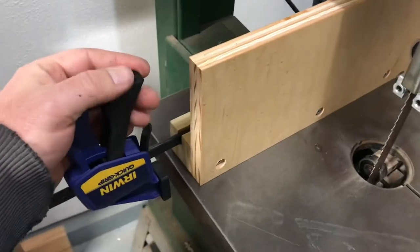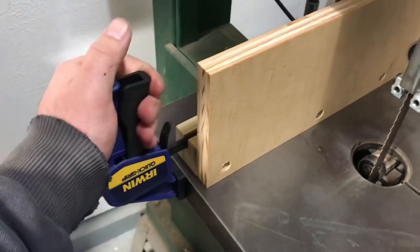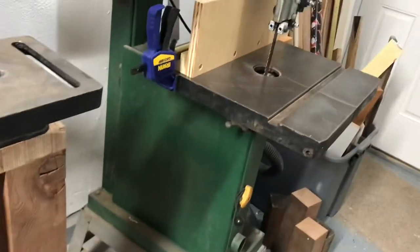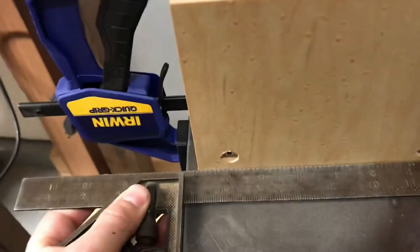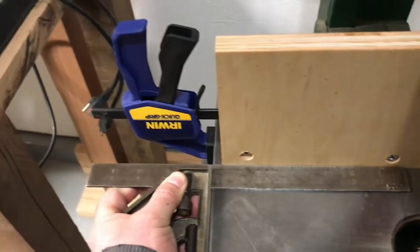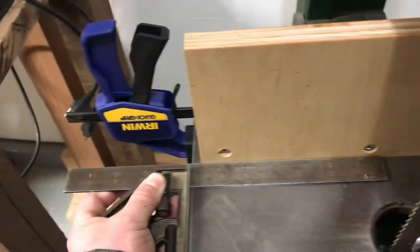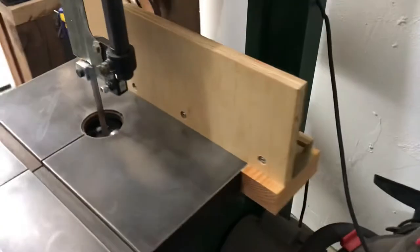So I've noticed it's about 50/50 — even with the spacing I put in there for the clamp to move, for it to be perfectly square. But what's nice about this setup is you can grab your speed square, regular square, whatever you've got, and just verify it. This is one of the 50% where it worked out perfect — it's in there square. Like I said, about 50/50. Super simple though: just loosen the clamp, butt it up against the square, and retighten it. For quick stuff and resizing it's great.